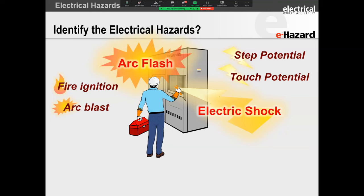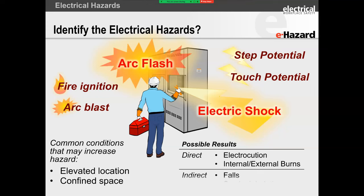So for your average motor control centers, panel boards, and distribution panels, some of the newer research shows that it's highly unlikely that arc blast is going to be a consideration. However, there is other equipment, like capacitors, where arc blast does become a consideration.